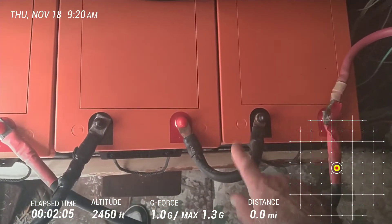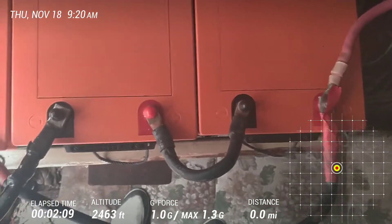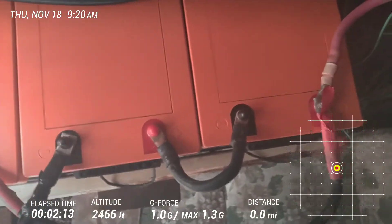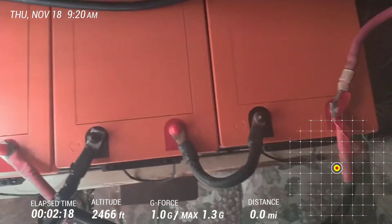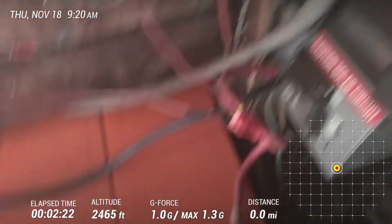Here's the parallel and here's the series — two 12 volt batteries in series for 24 volt nominal. It's really 12.8 times 2, which would be 25.6 volts nominal, which is great. The Outback inverter just loves it.